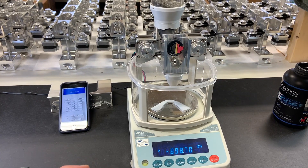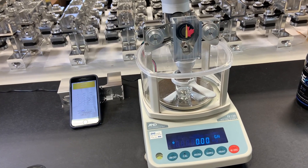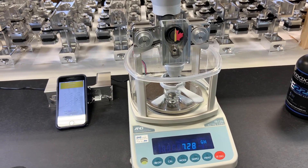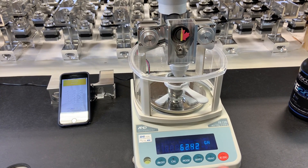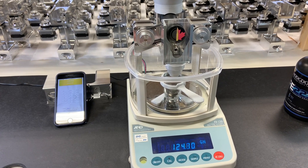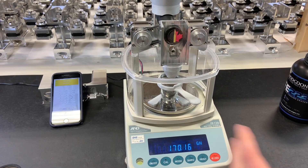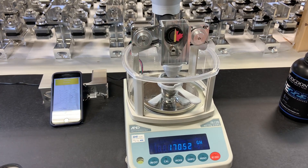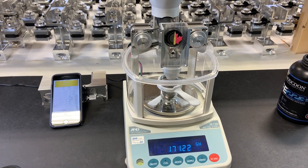I'm going to empty and do a calibration. What it's doing when it's calibrating is it's going to prime both tubes, run them for a while to try to get a consistent flow going, and then it's going to measure the flow rate at half speed. If it measures a really low flow rate, the motors are going to run faster when it's dispensing, and if it measures a high flow rate, the motors are going to run slower. So it's important that the measurement be representative.